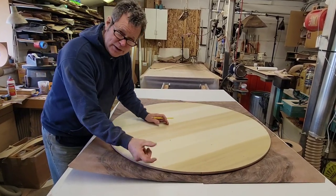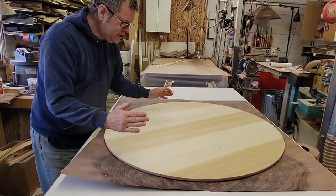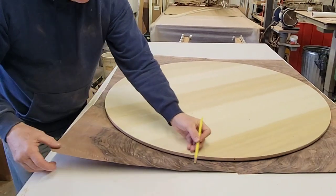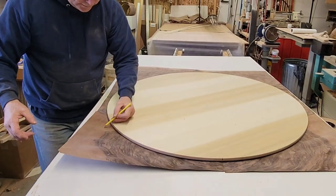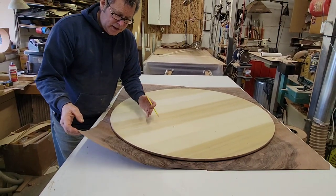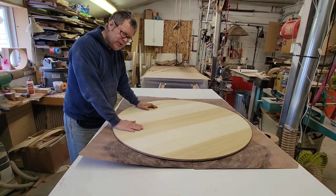You want a minimal amount of material so you can do that compound forming of that edge. We probably want about an inch of excess material, because more than that will just cause problems when I'm trying to roll it. So let's cut this off, flip this over, and get to our compound veneering.